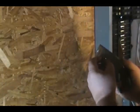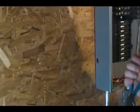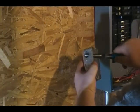All right, first off, we are going to pop off this lower, pop out the connector where we connect our box to. If you look on the box, you'll be able to see that you've got holes here that you can knock out to put your connectors in. Grab that, break that off. Of course, always remember to have your power turned off before you start.